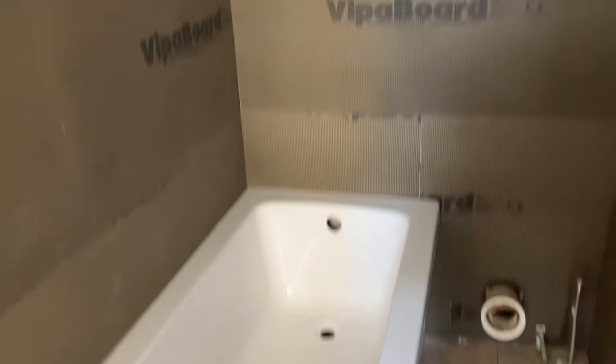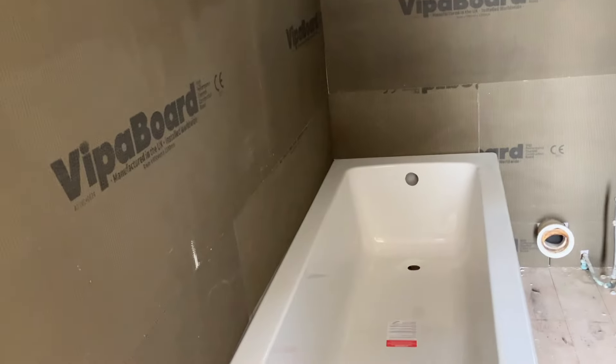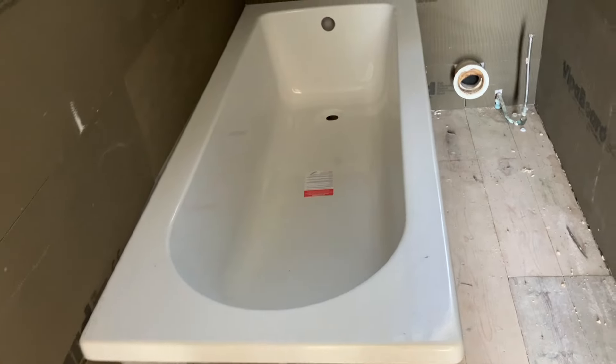Right, carrying on now with the job I started in the video before last — this is where the bathroom was ripped out. We've now got the construction board fitted all around. This is the windowsill — it's just waterproof MDF, 25 mil thick, glued in place; it gives them a shelf. Before it was sloping so you couldn't get anything on it. This wall's not being done because it's quite good — it's going to be okay to tile. So we're going to get floor-to-ceiling tiles. The bath's in position; the plumber's going to come and put the waste and taps on it, the tiler is going to come and tile the whole room down to the bath, and then we can fit the sink and the loo.